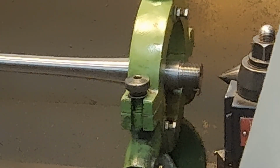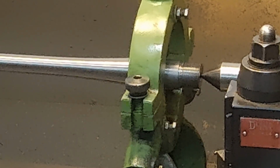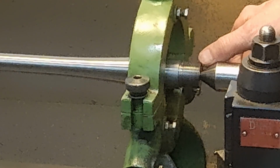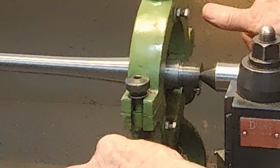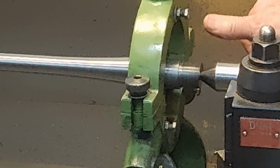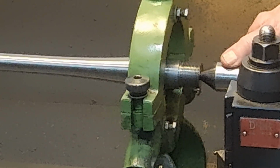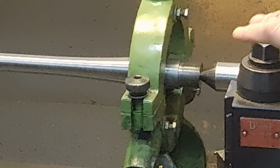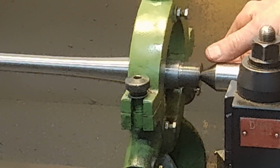And this is another positive aspect of this, is that if you do have a center that sits high or low, when you align your barrel with your center and set your steady rest up that way, the center and the bore will be perfectly aligned. And so that's another advantage of using the steady rest in conjunction with the tailstock center. You know that they are aligned, at least at the point of that center. And this has worked out really well because we took special pains to cut this center so that it was in line with the barrel.